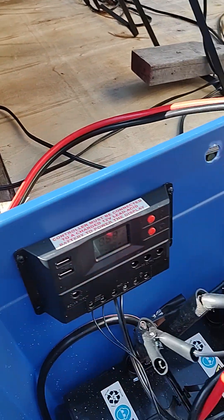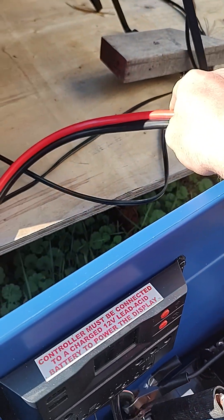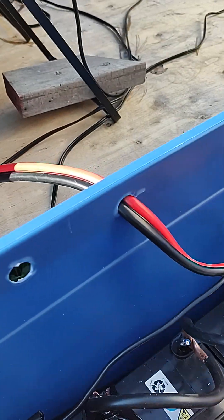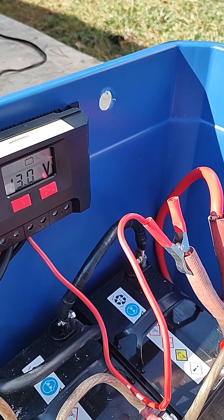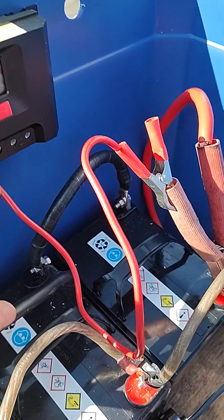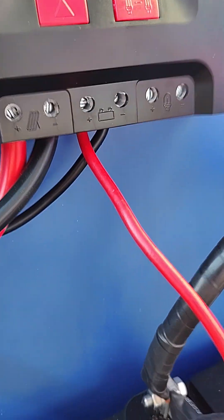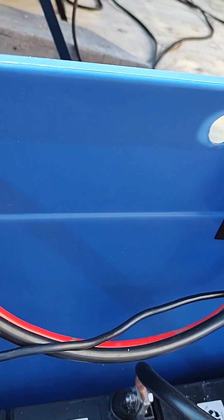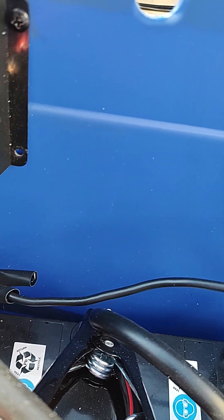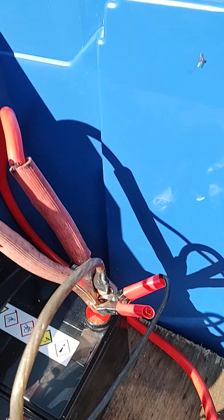The wire from the distribution box is eight gauge wire. I ran it into the charge controller, and from the charge controller on the battery port — I don't know if you can see that real well — but on the battery port I ran off two 10 gauge leads to charge the battery. I got one on this side of the battery rail and one on this side of the battery rail; they just kind of clamp on.